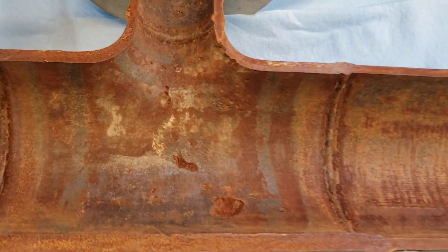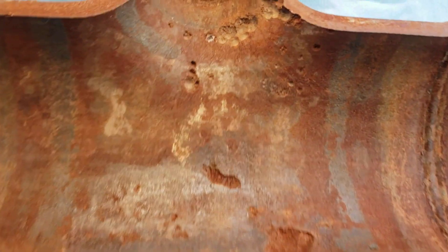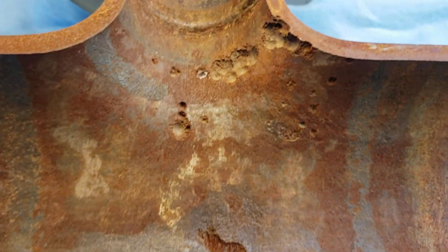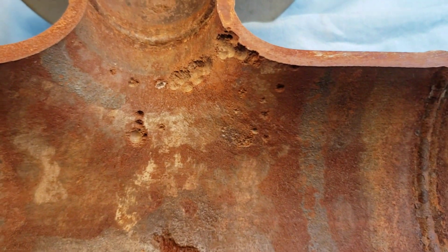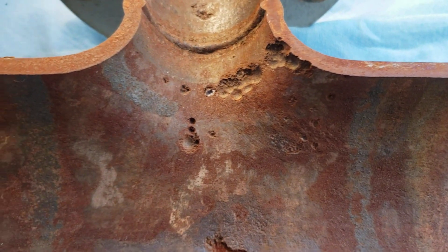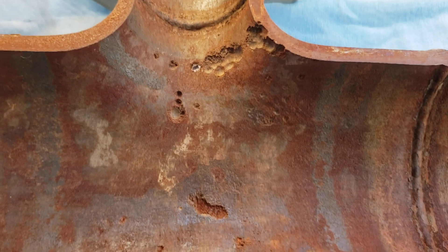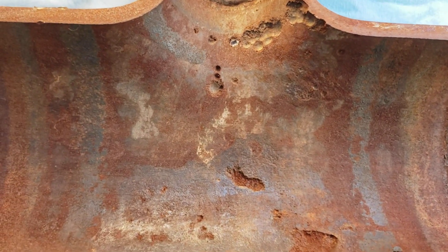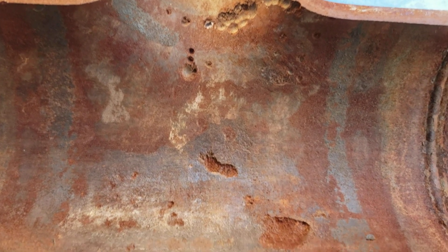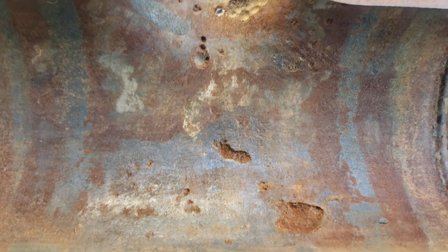This was a series of piping that was inspected by profile radiography. Let's see if I can get some side lighting in here to show some of the corrosion — to identify some corrosion and erosion. Cavitation-induced corrosion from damage mechanisms in the salt water and other stuff.